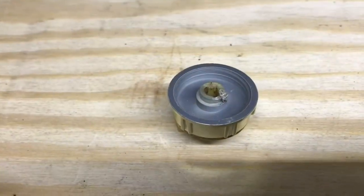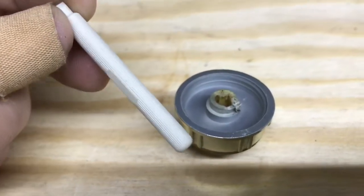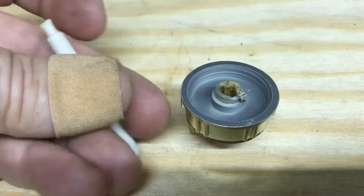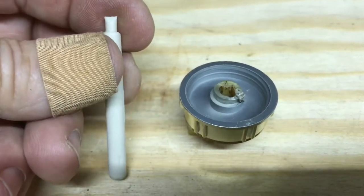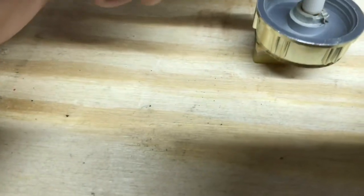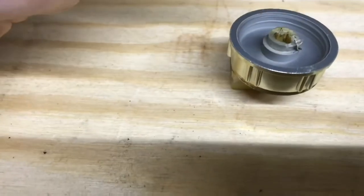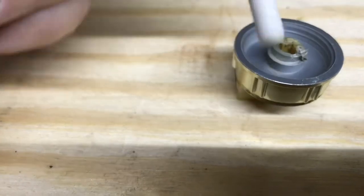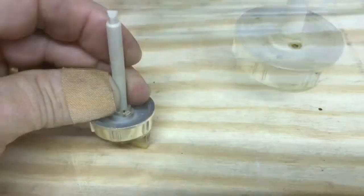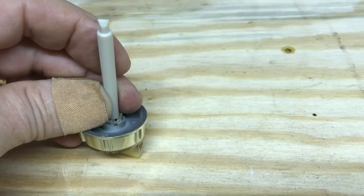The shaft I'm going to put in the on/off brightness knob will come from the end of an alignment tool — I've got all kinds of alignment tools so I'll sacrifice this one to make this shaft. I'll bore a hole in the center of the knob slightly smaller than that and then force it in there, put a little dab of super glue around it, and those extensions that I found will slide right onto that and on down to the control on the board.